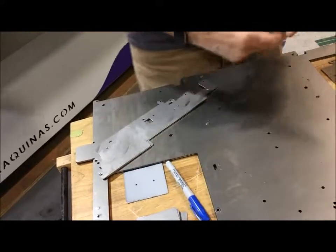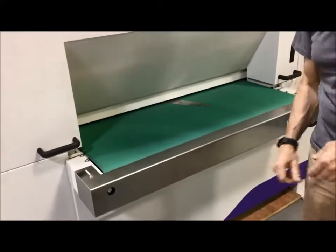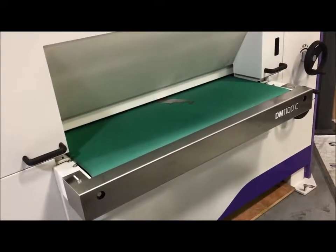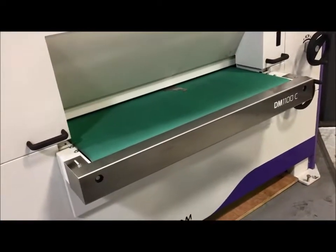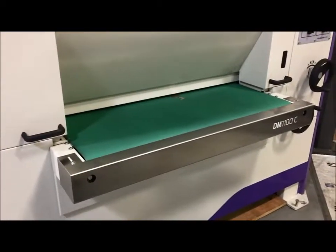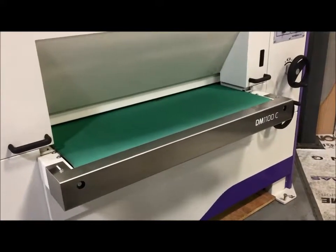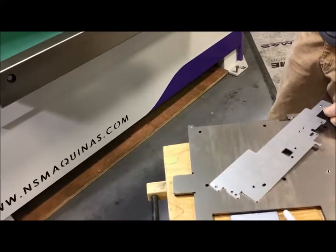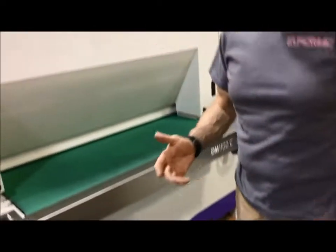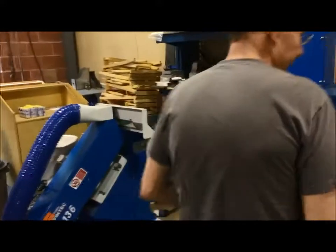But sometimes actually the brush speed doesn't make all that much of a difference. So now we're going to run this at 2 feet per minute with a brush speed of 100%. And normally in a part that size, brush speed is always 100%. There's no reason for you to go lower, of course. And then we will give you one part at about 3 feet per minute. In stainless steel, you want to go anywhere between 2 feet per minute and 4 feet per minute. And again, it depends on whether you just want to have a broken edge, it's safe to handle, or whether you really want to have a radius which paints better. You said you didn't paint those parts, so I put tape.